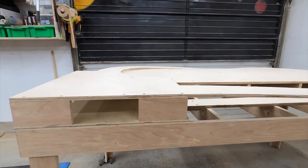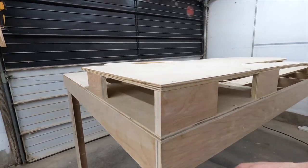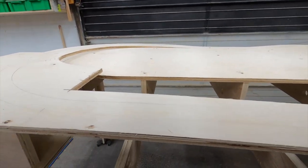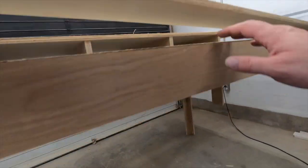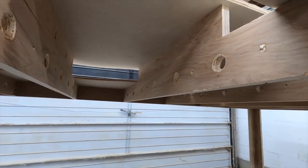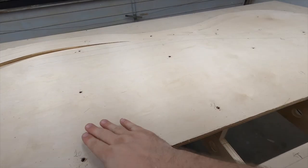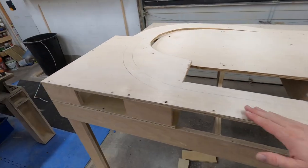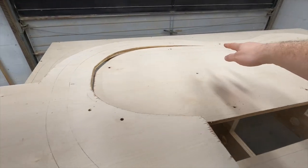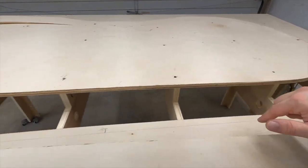I just got the risers connected. The back ones over here where the little tunnel is, I've got these secured so they're nice and flush. The idea is you're going to cover all of this with fascia, but you want to be able to get in there if a train derails. I've got the little two-and-a-half-inch ones secured as well — giving you an idea of what these look like from the bottom. They're secured with pocket screws into the top of the benchwork framing and then with drywall screws from the top. So we know this plane here is perfectly flat, we maintain our clearance underneath, and then there's a little grade down to the level area for the switches, and then it grades down again to go underneath.